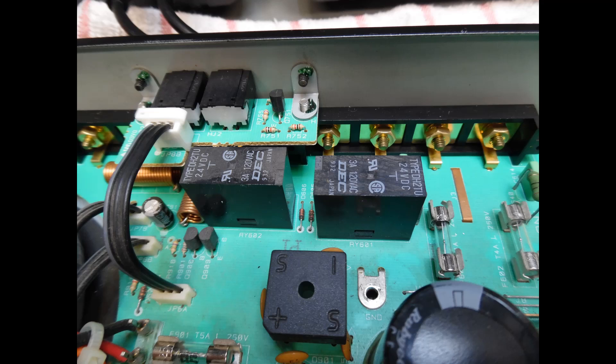So what I always do as a matter of course is to replace these relays. These relays are 24-volt DC coil and they are single pole double throw relays. These are common G2 case style, and you can remove the top covers, but this amplifier has seen reasonable service so I'm just going to swap them out, which as I've said on many tutorials will provide longevity of the repair.